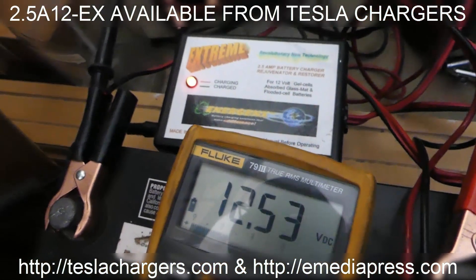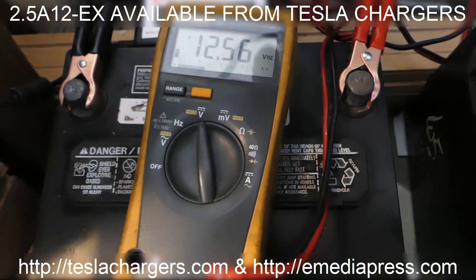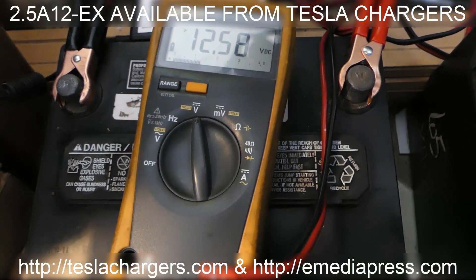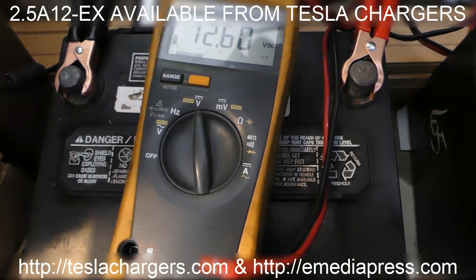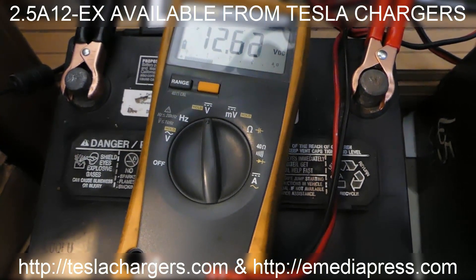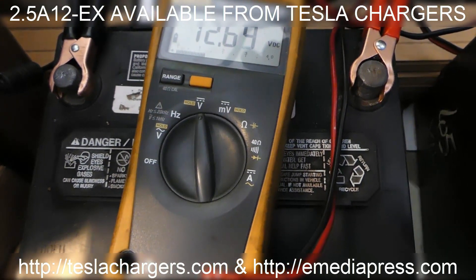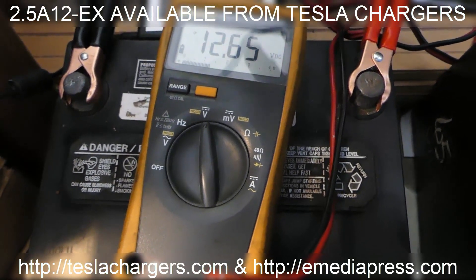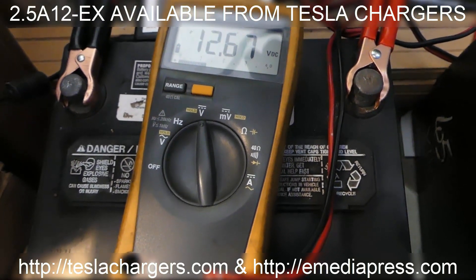You can hear that thing clicking — that's how fast the capacitor is discharging. A battery in good shape that you want to charge, you want to bring it to 15.3 volts if it's a flooded cell, which is higher than what the industry claims is safe, but that's because they don't know how to do it without boiling the battery to death. Removing sulfation is like an electroplating process where it's all about the voltage and has very little to do with how much current you're running through it. You can bring one of these flooded cell batteries to 14.8 and boil the hell out of it with a conventional hot current charger and it's not going to get any of the sulfation off. This is going to push it up to about 16 volts because the sulfation acts like back pressure for the voltage, and that much impedance is going to force the voltage up on the battery.